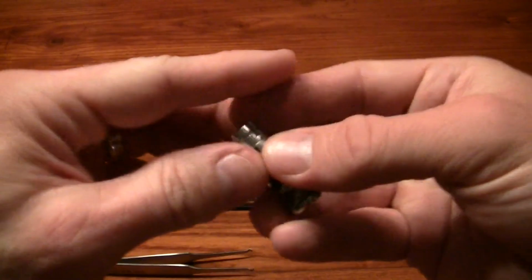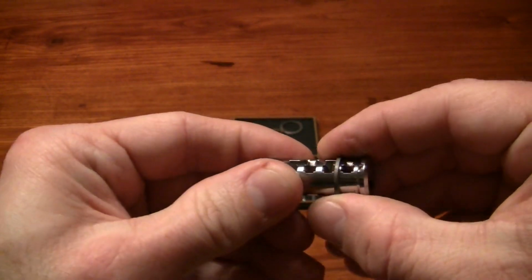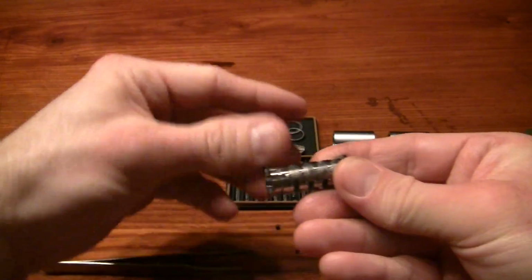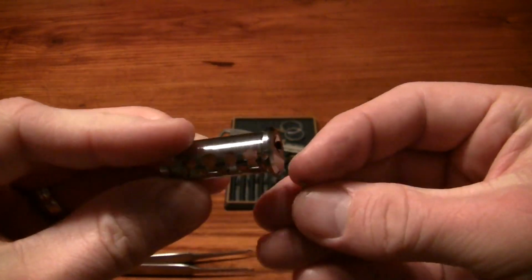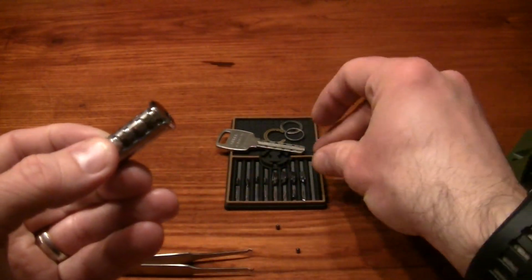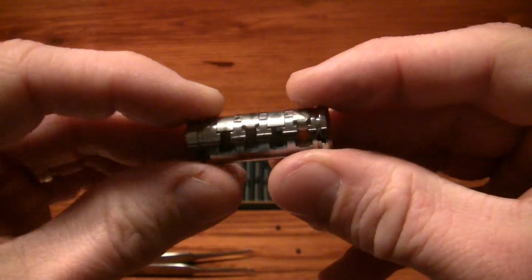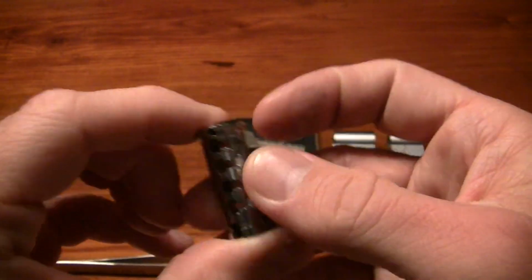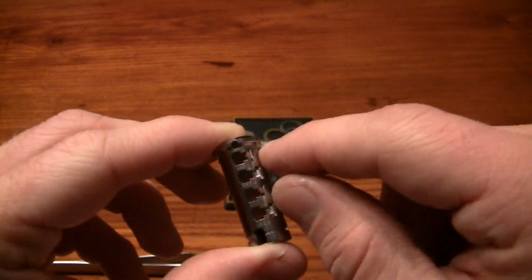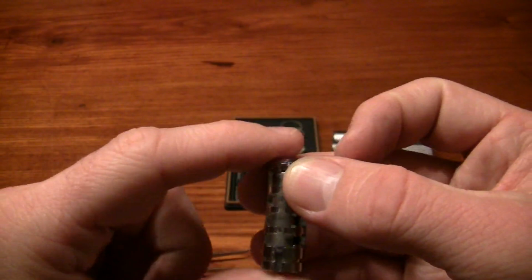Okay. And there is another washer in the front. Plus there's some sort of anti-drill element protecting the sliders. It was right here. Here are the chambers for the sliders. As you can see, these pieces of metal, 2 of them, are actually made as stops for the spring. So the slider directions are alternating.